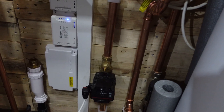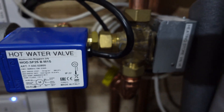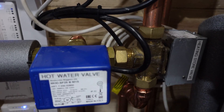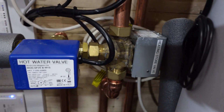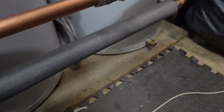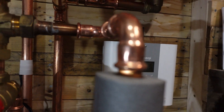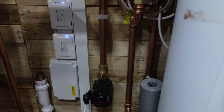How do I get heat into the store? Through Home Assistant automations I can bring in weather data, energy APIs, and that sort of thing. Once the thresholds or circumstances are right for loading the store, this port shuts, the heat pump comes on, this port shuts, and flow comes down the pipe into the store, back out at the top through the valve at the top, and then back into the return.